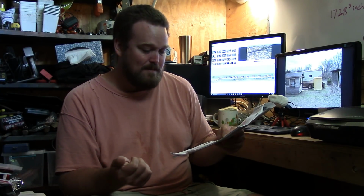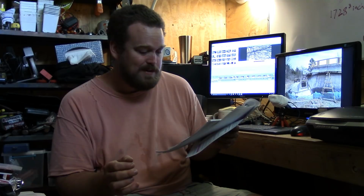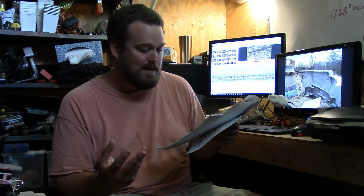The fine aggregate must not have more than 45% retained between any two consecutive standard sieves. So, sieves. So that's the test I was talking about earlier, the sieve test. We can actually scientifically count the particle size and how much percentage goes through each micrometer size screen, okay?